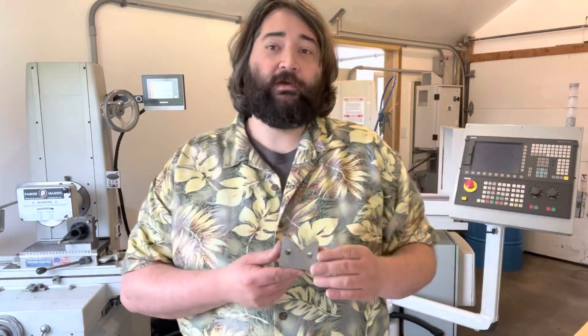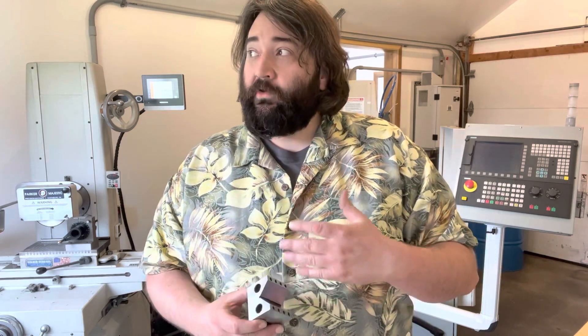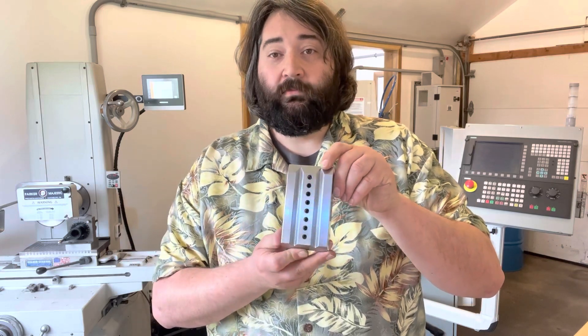The v-block is probably one of my favorite things to make as a tool die maker. A lot of things have to go quite right in order for it to be a good v-block. It has to be flat, square, and parallel. You have to have good angular surfaces and overall you have to adhere to a strict process in order to get everything to come out the way you want it. That process most times is grinding, but this v-block is hard milled — you would never know it. It looks near ground.